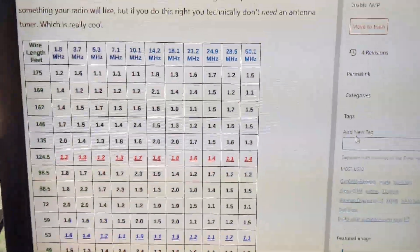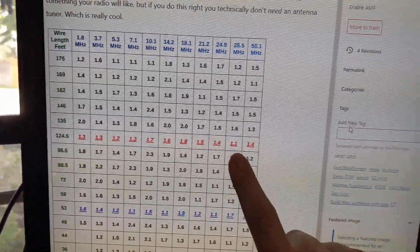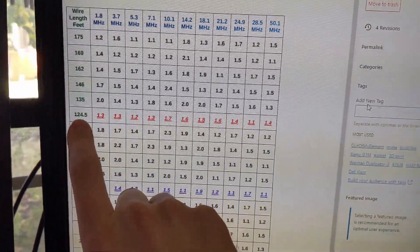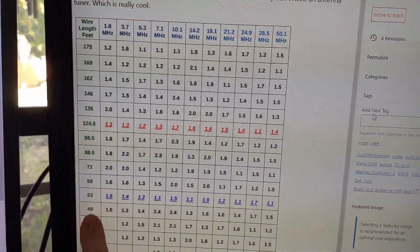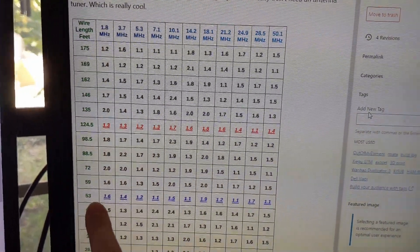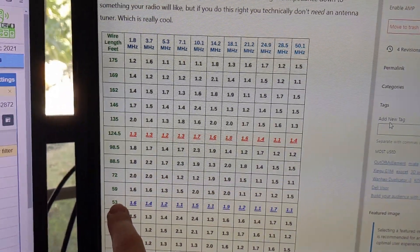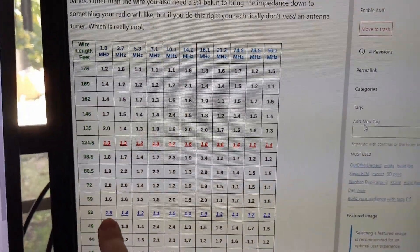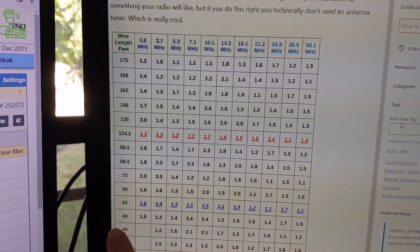So you pick what frequencies and bands you want to use. Of course the best option is a longer wire, but I picked this one because it's second best and I just don't have room for a 124-and-a-half-foot antenna in my front yard. They're decent-sized lots, but I need to use my trees. I tried getting up on the roof and I don't want to do that again — that was not fun. So I used a 53-foot wire — I said 56 earlier, but it's somewhere in there and I need to tune it still. I need to trim a little bit because it's not great on, I believe, 15 or 17 meters — it's almost 3.0 SWR, and that should be much lower.